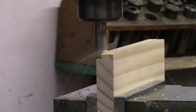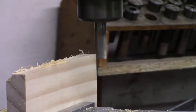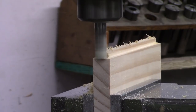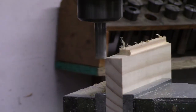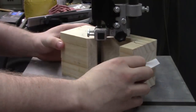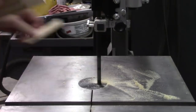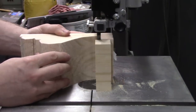The first step I decided to do for the flanges was to cut the tenons that will fit into the mortises on the shaft. I did this back on the milling machine after simply cutting out some rectangular blanks for all of the flanges, and it was a pretty easy process — definitely the easiest machining step of the whole thing. After that it was time to cut out the actual shape of the flanges. To make sure all of the flanges would end up the same, I simply stacked them up with some weak double sticky tape, drew the design on the top flange, and ran them all through the bandsaw to give me five equal flanges.